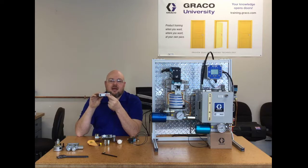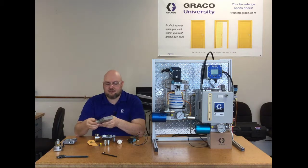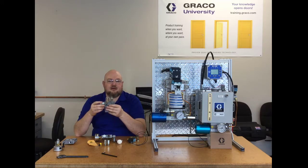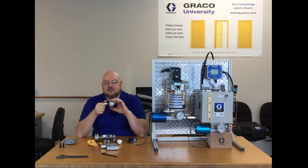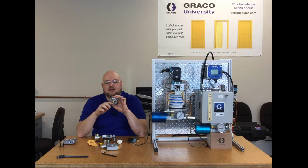The lube inlet is out here where the gauge port used to be. So if you're doing one of these, don't worry about O-rings at this stage. And then on the BSPP version, this still needs an O-ring. You don't need thread sealant on all of these connections because these have a soft seal on the face — that's how BSPP seals, with a face seal. You still get a yellow plug here. For the gauge, we still use NPT gauges and they just come with an adapter. This has a face seal here, but you'd want to put some thread sealant on the gauge itself when making this connection.